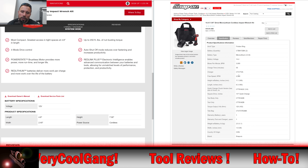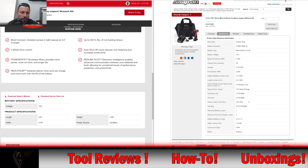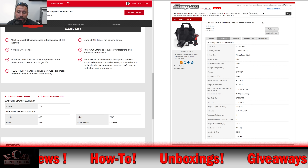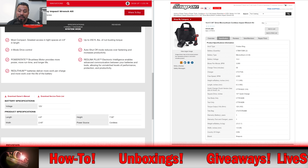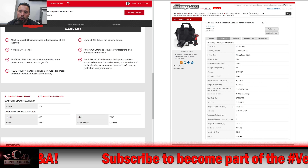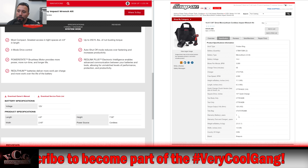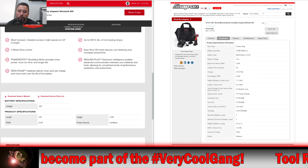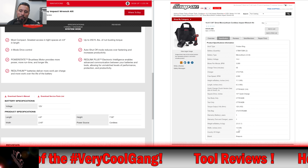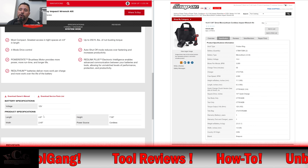Going through the specifications: anvil-type friction ring, 3,000 blows per minute, 55-minute charge time, 2,500 free speed RPM. Height with battery is 7.7 inches compared to Milwaukee's 7 inches. Length is 6.3 inches for Snap-On versus 4.8 inches for Milwaukee — how stubby is the Milwaukee! Torque output is 120 foot-pounds. It does come with a tool bag. Now here's a big one — warranty. Battery: one year for Snap-On compared to Milwaukee's three-year warranty. Tool and charger: one year for Snap-On; Milwaukee gives you a five-year warranty. The Snap-On comes with two 2-amp-hour batteries. We're a little fatter on the stubby, but that would be the definition of stubby — short and stout.